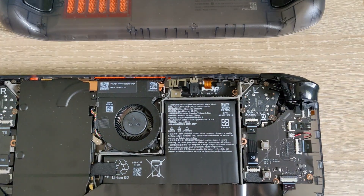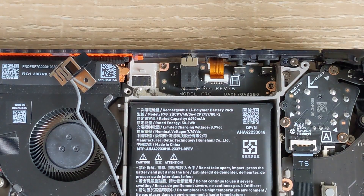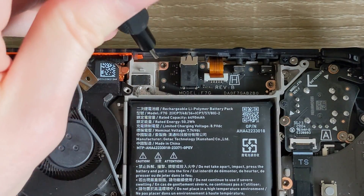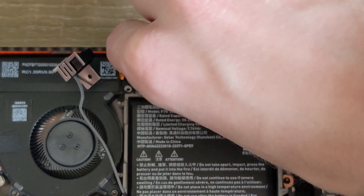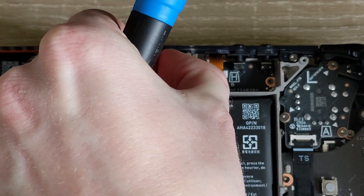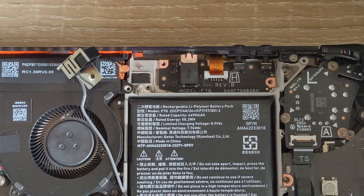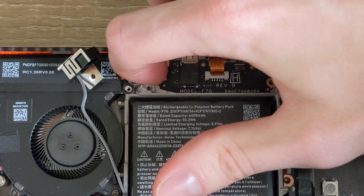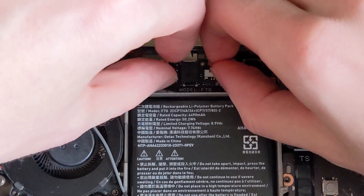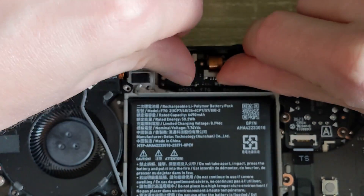All we're going to be doing — I already unscrewed the Wi-Fi adapter and pried it up with a spudger — and I'm going to use the same hex screwdriver and unscrew it. On the guide that originated from Reddit, people just unscrew it and put kapton tape in it. That's not going to isolate you from ground, because ground is usually also underneath.